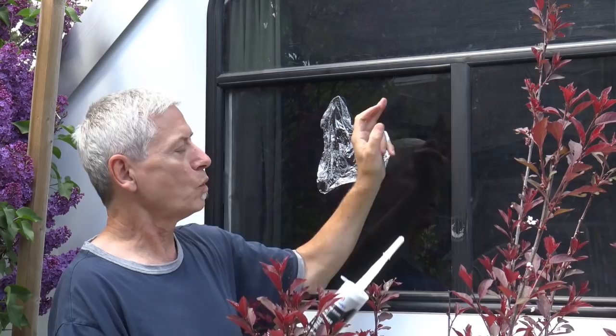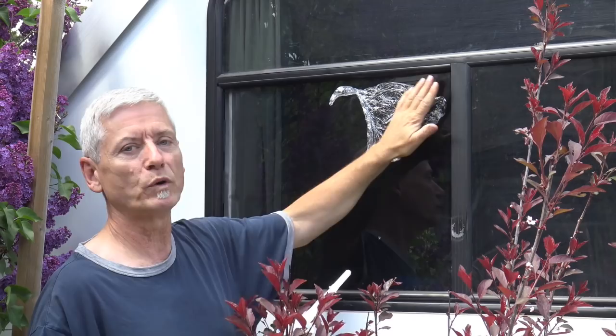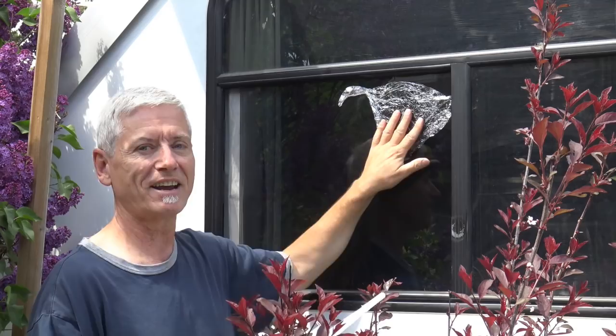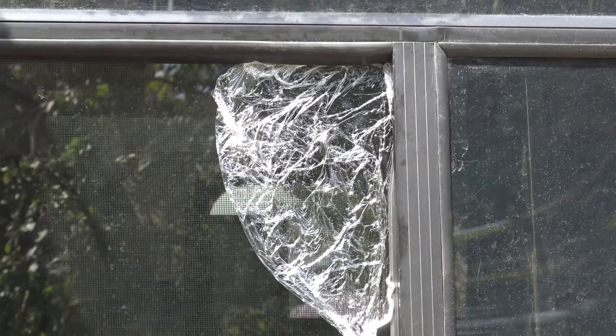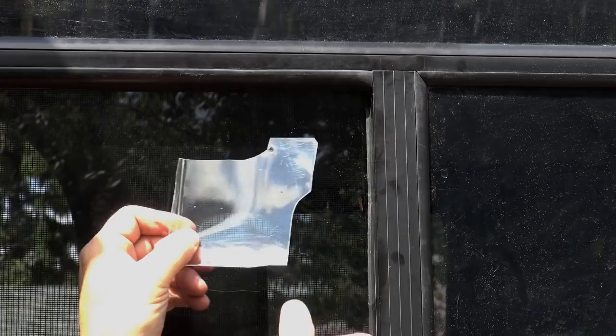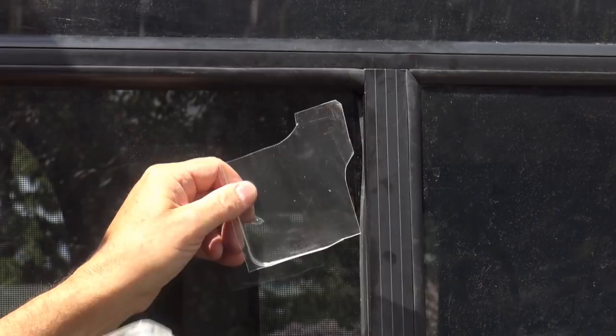To fill in that gap with sealant, I first tried a little bit of saran wrap in the corner, sliding the window across — since this is one of the windows that actually slides open — so the caulking doesn't glue itself to the window. In practice though, the saran wrap proved inadequate. Instead I made a barrier with cheap plastic from packaging, coated one side with Vaseline to help guide it in place and prevent the caulking from adhering. I then found a little gap in the weather stripping and slid the barrier up into place.